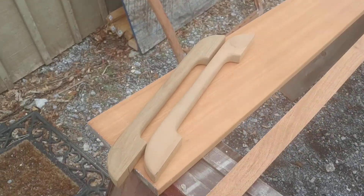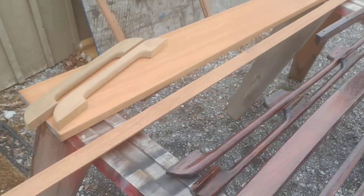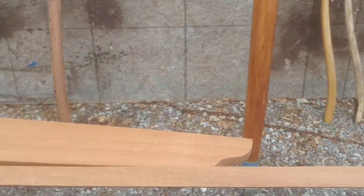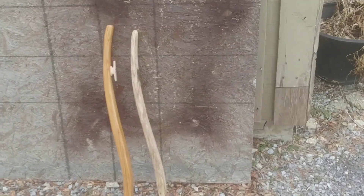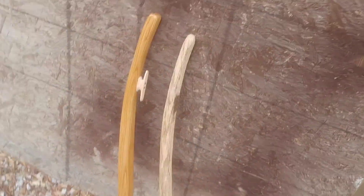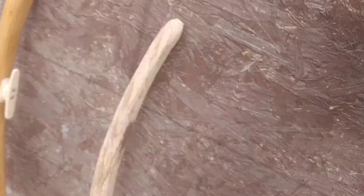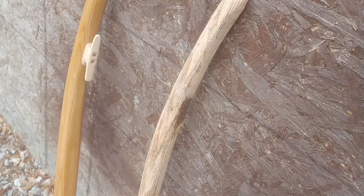There's one of the combings for the cockpit. Decided not to do it in plywood as it was done originally, but to do it in a piece of mahogany. The tiller handle had to be replaced — it was fairly well weathered. Used it as a template and made a new one. The original tiller actually had a cleat on it.